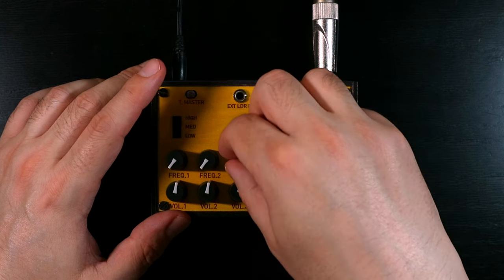If I had one bone to pick with the Monocassa from a sonic perspective, it's that this clock source, which is used to ping the filter, has quite an aggressive attack, which can be useful, especially when you start to bring in the distortion stuff, but I kind of favour more mellow sounds in a lot of cases. So one thing that is an absolute beautiful pairing with the Monocassa is a passive low-pass gate. I've just got the little Pusherman 0 HP one here. And if we bring down its tone control, some of that clicky attack is tempered somewhat.